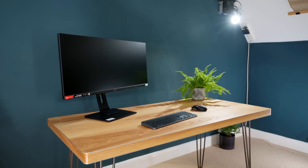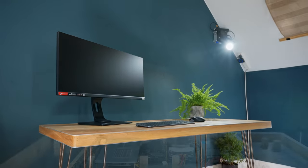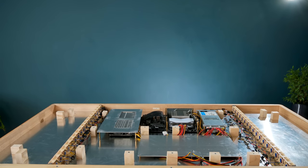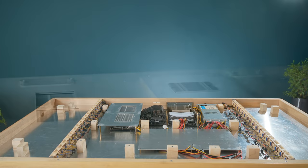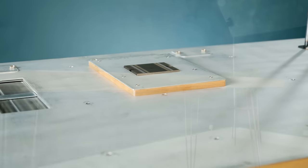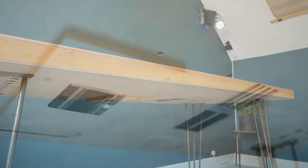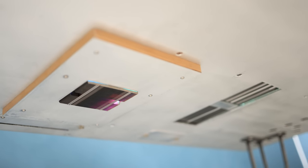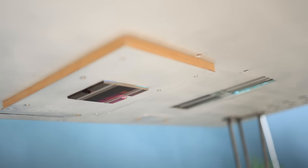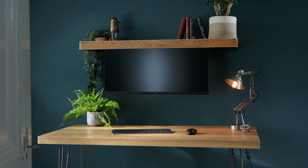The original build relied on a bespoke air cooling system, which worked pretty well and was chosen to make the system much easier and cheaper to build while remaining quiet in use. It did require some raised sections for some components' headroom, however, spoiling the overall elegant thin look if seen underneath, and it also bordered on thermal throttling, meaning that the design had an upper limit for upgrades and wouldn't really have been able to handle the latest high-end CPUs, for example, which is a shame as it's such a unique design.